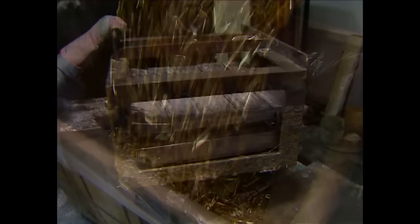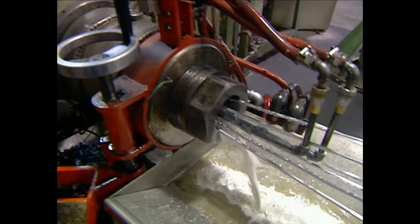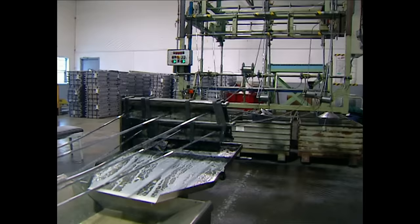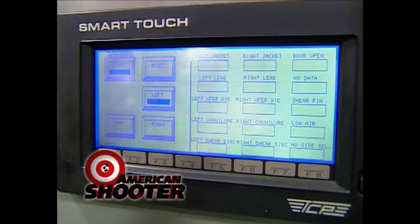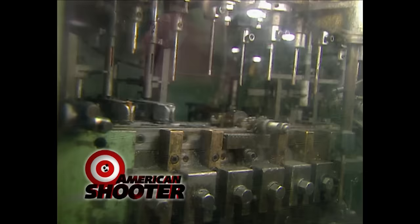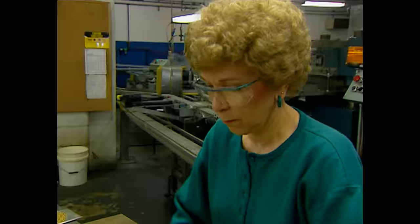But we need bullets, and most start here with ingots of lead going into the furnace to come out as a three-inch cylinder, solid but still hot. And with 200 tons of pressure from the hydraulic ram, the lead cylinder literally sprays out as lead wire, extruding six strands for this order of nine-millimeter bullet cores, wound into coils to supply the cutting machines. That is the next step in the process, feeding wire into the machines that cut and form the core. Then it's a quicker-than-the-eye series of steps as the jacket receives a core, is seated, flipped over, formed, sized, and rolled to press the cannellure or knurl around the center. And we've got bullets, ready for loading.